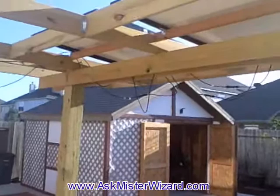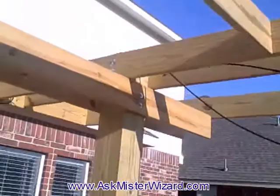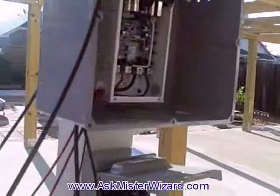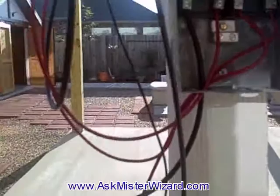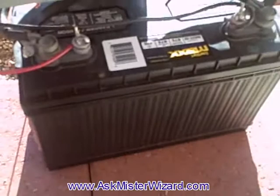But there it is. These are the basic elements of my solar power system: the solar panels wired through my safety fuse box right there, then up into the charge controller — the brain of the operation — which takes care of charging this storage battery, which in turn is wired to an inverter that produces household-compatible AC power.